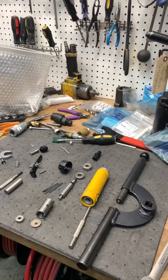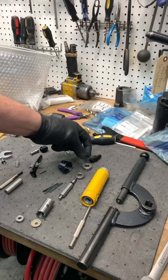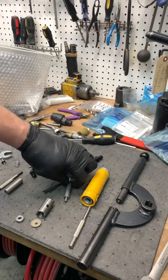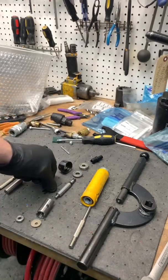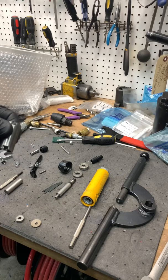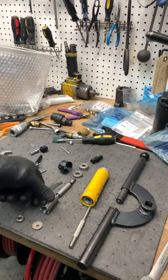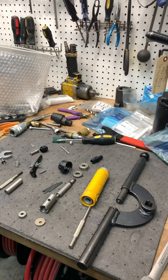Okay, so here is the motor disassembled. You have the collar adapter, the front end bearing, the front end plate, the rotor with the spacer, the vanes, the cylinder, which is directional. Note the little tab on the bottom of the cylinder that connects to the rear end plate. So the cylinder, the rear end plate, the rear ball bearing, and that's it. It just goes together in reverse.